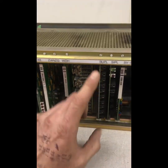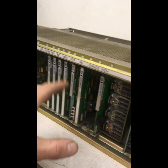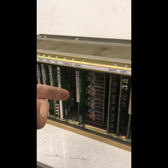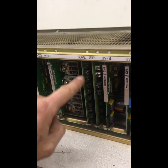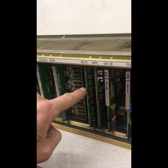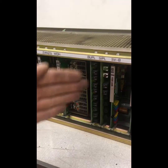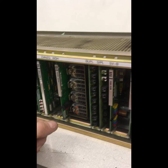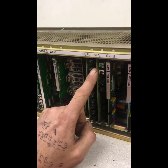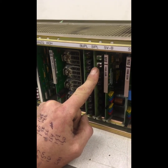You also have the bubble card, which is where we measure all our voltages from. The incoming heads out on the track — if we were to have a standard axle counter section with one pair of axle counter heads counting in (that's SK1 and SK2 heads) and then the exit SK1 and SK2 heads — they come in on these terminals. A pair 1A and 1B would be one pair of counters, and out on the track 2A and 2B would be another pair. You can have four of them. Some axle counters go across points and junctions, so you may count in on one head and out on a separate head, and sometimes the count-out heads are in another evaluator unit, not always in the same evaluator. There are also fuse cards on the side and a status LED — green and red, track up and down — driven off the relays.